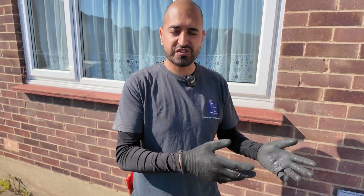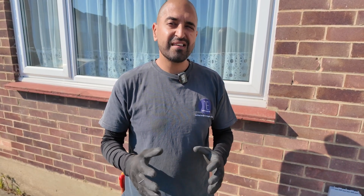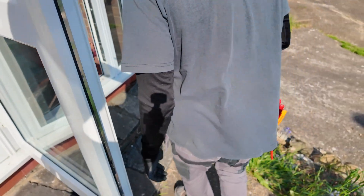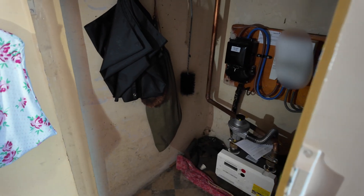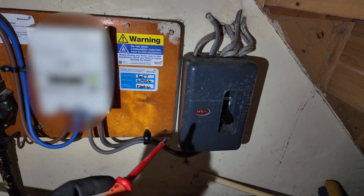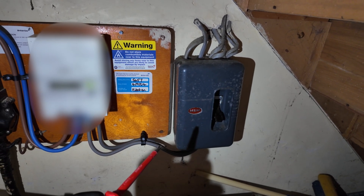Two, if there's ever an issue with the charger, you don't want it affecting the actual house electrics. So what we always try to do is put a separate board in from the house. I can show you inside how it looks and what we're going to do — the board we set up separates everything, so with old house electrics we can get around that and install an EV charger without touching anything existing. Let's take a look inside. We're dealing with something quite old in here — I think the main board still has asbestos breakers, which goes to show.